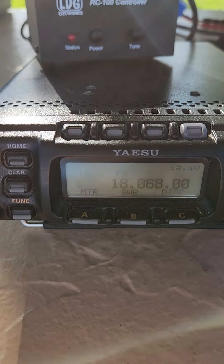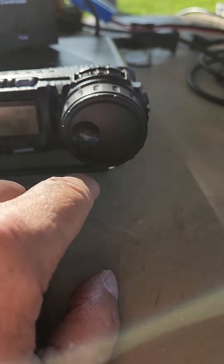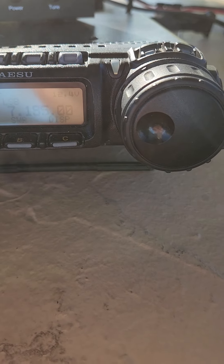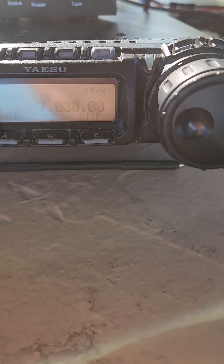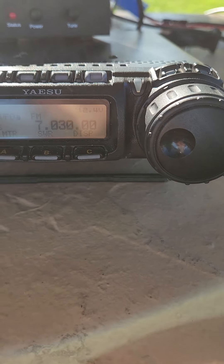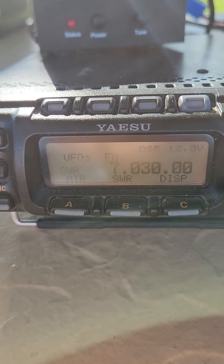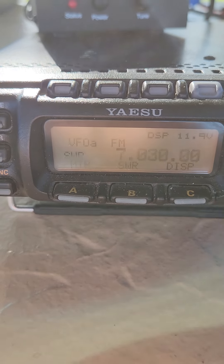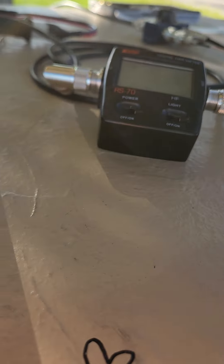The bottom line is you've got an antenna that'll do many many bands. Let's push it to 40 meters — going down into the CW portion of the band, find a nice quiet spot. And it tunes up on 40 meters! I'd previously trained it so it was pretty close. On 40 meters: 9 watts, 1.0 SWR.